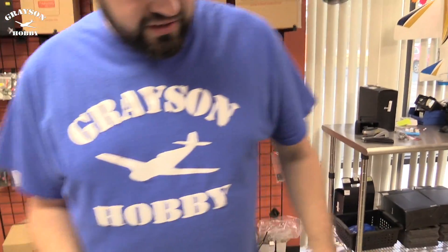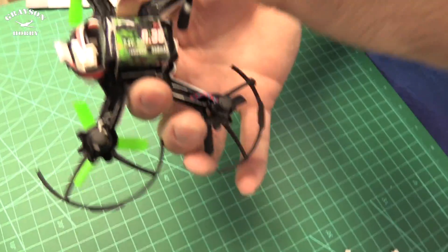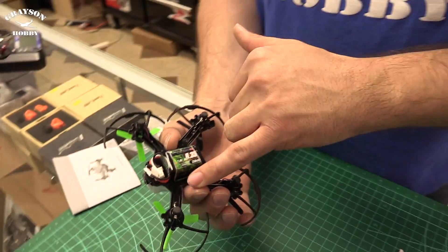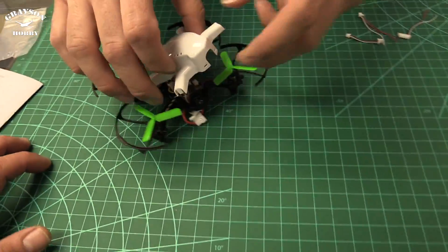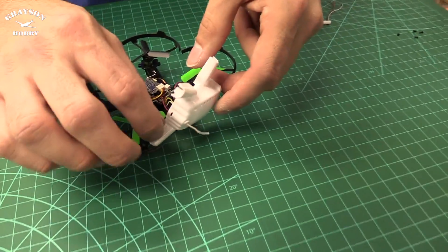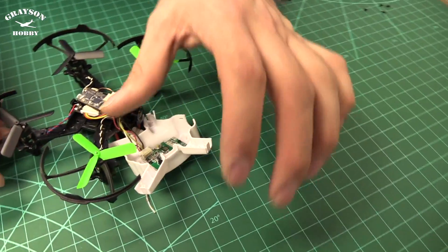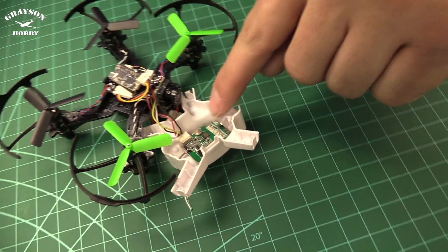All right — so you saw how to bind it, saw the flying and the crashing. Now, as promised, we are gonna dissect the frog — take a look inside the Q90. First things first, you've got to take the four screws off the bottom in the corners. Pop it off with a little flathead. You've got the body off now — you can't just pull it off because there's a cable there for the video transmitter, so just move it to the side carefully. The video transmitter — 200 milliwatt — is right here, and the channel-changing button is right there. That's how you change channels, and the LEDs for the different channels will light up when it's powered on.